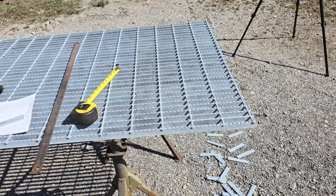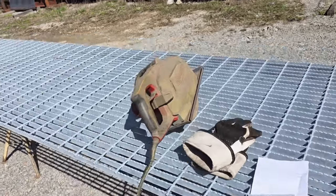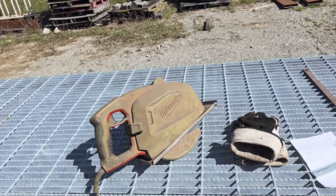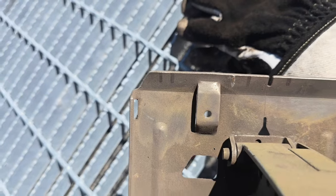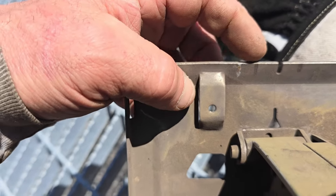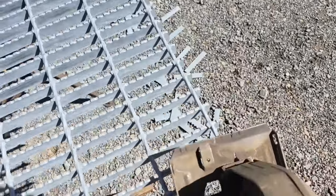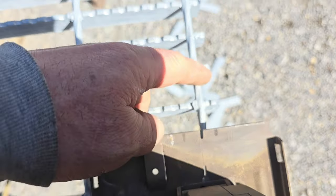It's not real easy to mark with a really accurate mark. And when I cut it with my Milwaukee metal cutter saw, this circular saw type saw, low RPM, tungsten carbide teeth metal cutter, usually what I'll do is I will look at the fence on the saw here. If you look at my fence on my Milwaukee saw, I can tell you my blade is right where this notch is. So I know where my blade's at. The next thing I'll work out is which one of these other little notches, and sometimes I'll make a mark on here with a marker if I need to, I'm going to put in the center of the rod, and I'll basically be following that round bar rod with a certain part of the fence of my blade.